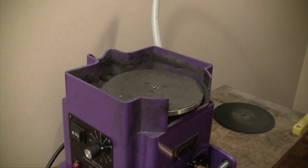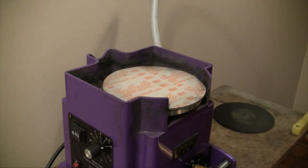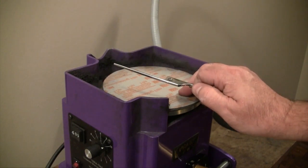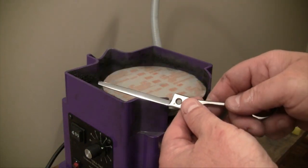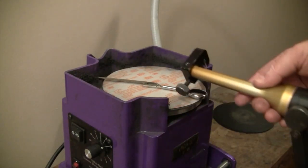For the sake of time on the video, I'm not going to go through the 30 and the 9 on the sharpening — Bonnie is doing a video on basic sharpening and will walk through all the steps. There are a lot of people who will just do a 15-micron on the outer edge and then polish. It really depends on your style of sharpening and what your customers' tastes are. If you want a much smoother and shinier surface, always go through all the steps: your 30, your 15, and your 9, to smooth out the front surface of the blade, then do your polish. So I'm going to go ahead and bring up a burr on this — it should be somewhere around 40 degrees.